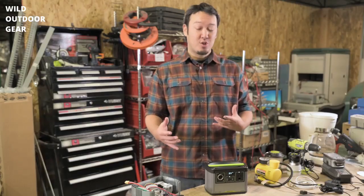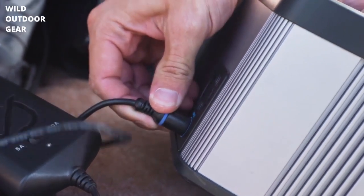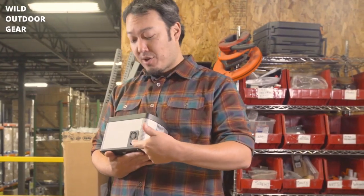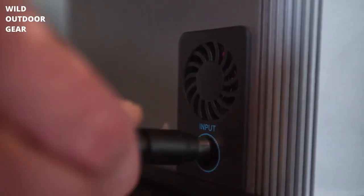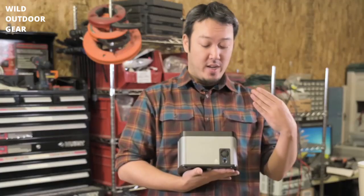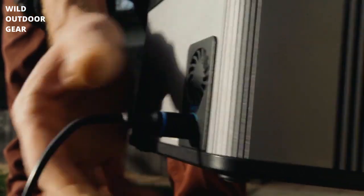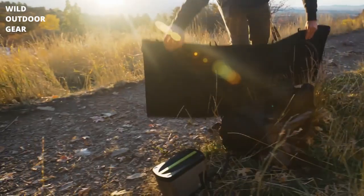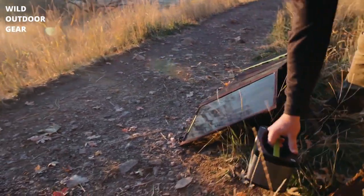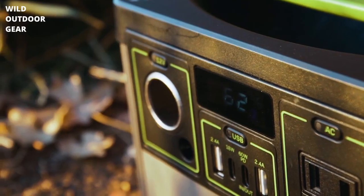When it comes time to charge this little battery, we've actually put the input port on the back for the first time, so now we charge right through here, same way we did before from the front. From the wall, we can charge at 50 watts, so this thing's going to take about three and a half hours to charge up. We can actually maximize a better solar experience now that we have a maximum power point tracker charge controller instead of the old PWM charge controller. If we put a 100 watt solar panel on there, we can charge this thing up in about three hours.